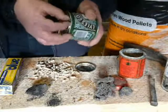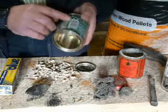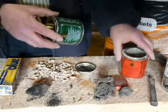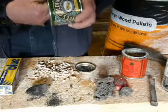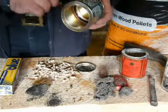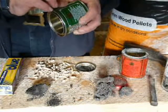The basic method of making pellets: imagine a solid steel ring with rows and rows of holes all the way around the outside, and inside there are two heavy-duty rollers. The material goes in there and the rollers roll around — a bit like an old-fashioned paint mill or an apple crushing mill — and the action of the rollers pushes the material through all these holes. This is what's called a die. The pellets are pushed all the way through the holes and stick out until they break off and fall down.